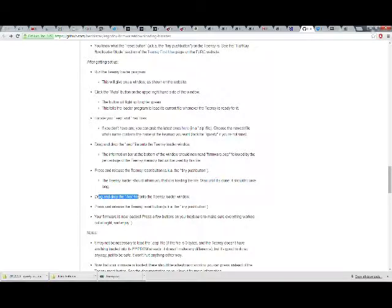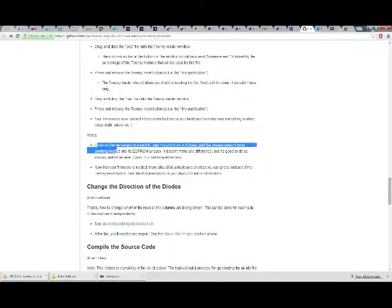Drag and drop the hex file onto the Teensy Loader window. Press and release the Teensy reset button, aka the tiny push button. Your firmware is now loaded. Press a few buttons on the keyboard to make sure everything worked out right, and enjoy. Notes: it may not be necessary to load the EEP file. If the file is 0 bytes and the Teensy doesn't have anything loaded into its EEP ROM already, it doesn't make any difference, but it's good to do so anyway, just to be safe. It won't hurt anything either way.